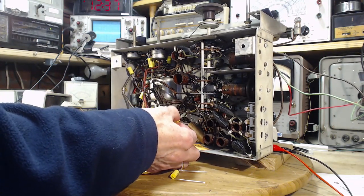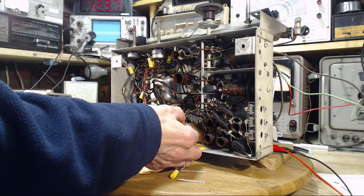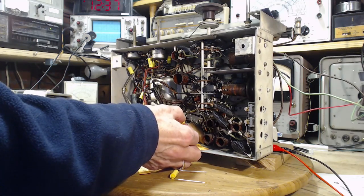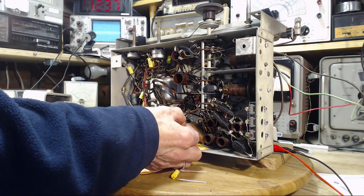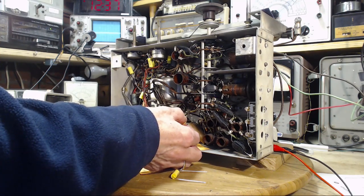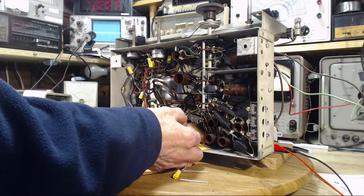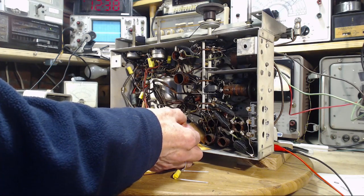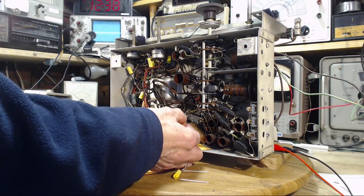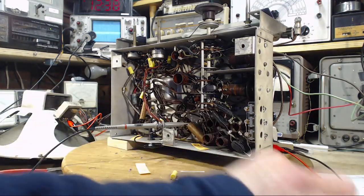Okay, are we ready? Watching the scope. Ooh, little pop there. Did I see it disappear? Much less. Not completely disappearing though. Now if that old capacitor is good and it's got 0.1 in it and I just changed this from 0.1 to 0.2 by paralleling in another one, then yeah, you'll see that effect. But if I cut out the original and put in the one I'm holding, it'll look like this again, because it's just 0.1.